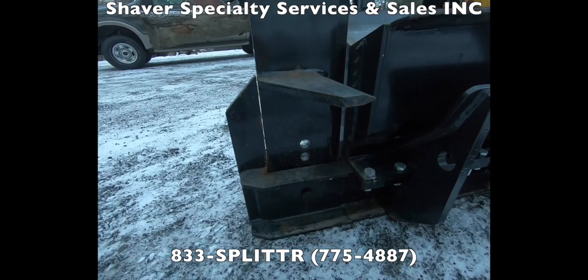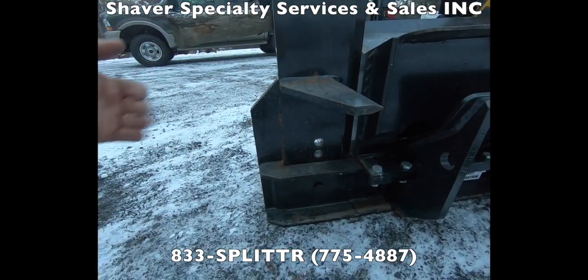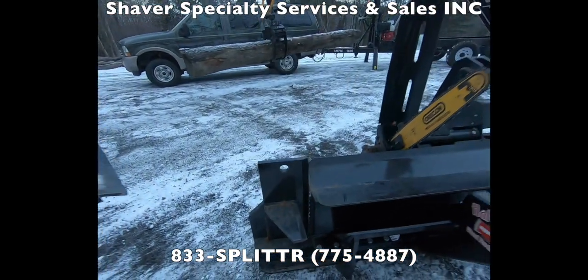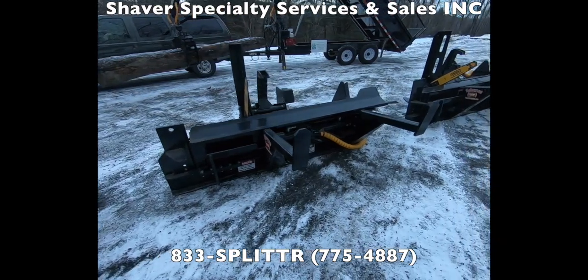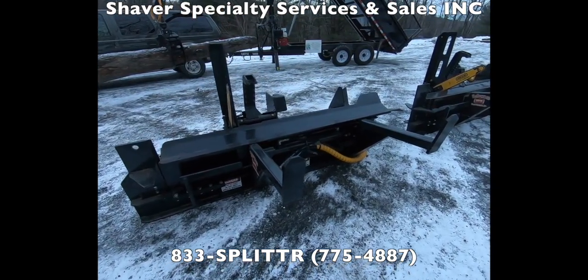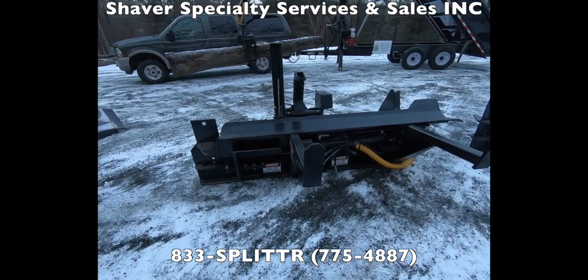Once you take out the adjustable wedge, then with this piece being gone, now you can cut and split rounds right out the processor without ever having to split it. So if you're working with something that's maybe 4-inch, 6-inch for the outdoor boiler, you can just go ahead and just cut it to length and knock it right out.